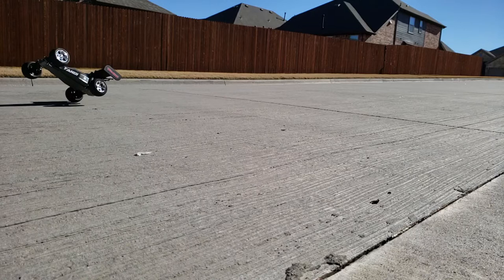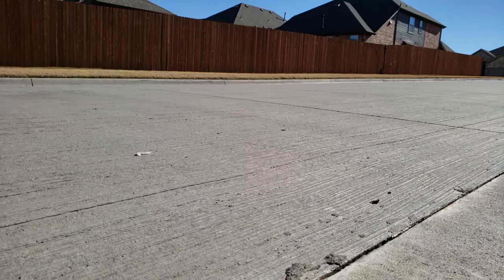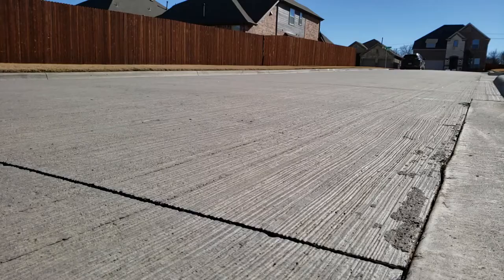However, with the added weight over the back, the drag up that high, and the downforce only over the rear tires, it gets unstable as you see here. Whenever I gave it a little bit of throttle while already moving, it lifts the front end right up. So it's not entirely desirable to run this with just one wing — it actually makes it really hard to control. And that instability is substantially worse in reverse, as the rear end gets really light and we get speed wobbles.